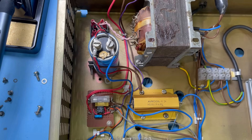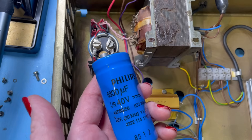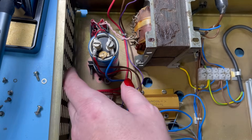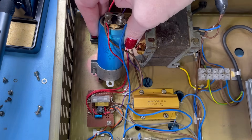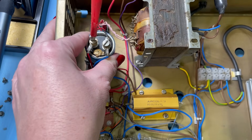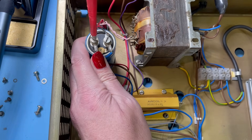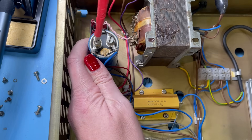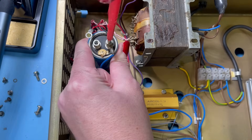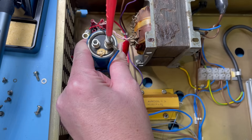Hoping these screws will fit in the replacement capacitor. I have a replacement here — new old stock, Philips 6800 microfarad 40 volt. I believe the one in here was a 5000 microfarad, 16 volt. So a bit of an upgrade. But it's a part that I've got in stock, so I might as well use it. Really tough — didn't want to let it go.